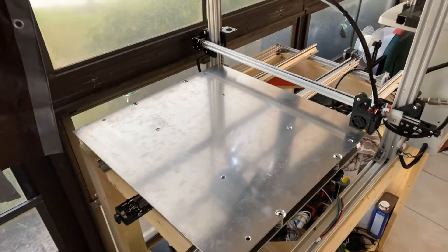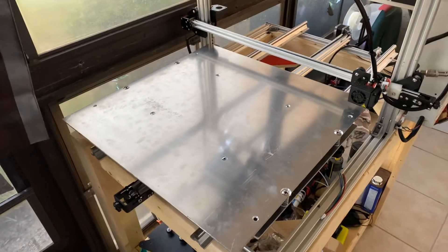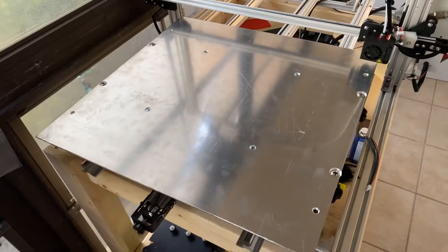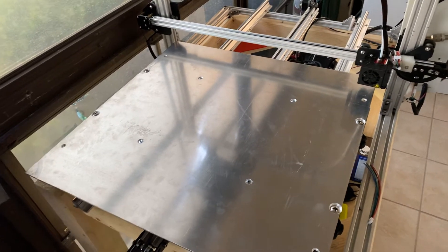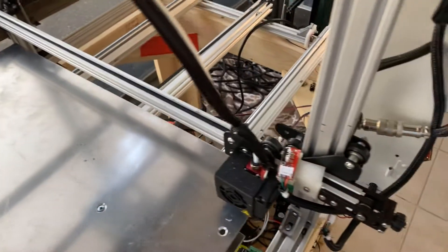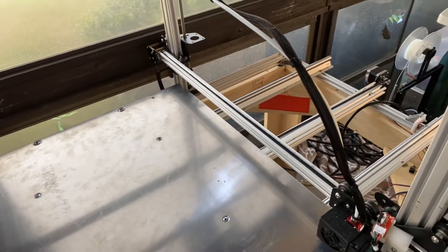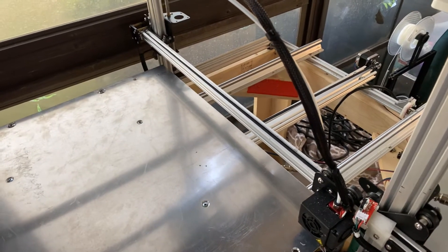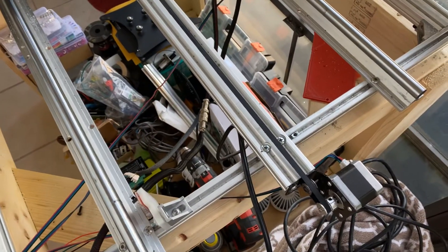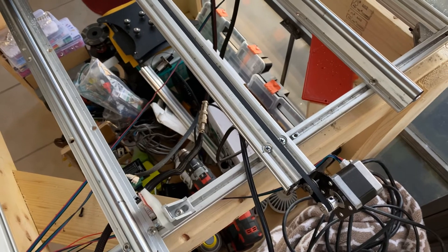Here's a quick update on what's going on with the large 3D printer. I'm definitely running into some snags as you can see from some of the previous videos, but I'm definitely working on something hopefully promising. The belt drive and all that stuff keeps missing steps when you start getting bigger printers — that's when you start having serious issues. Even though I'm still running on little NEMA 17 motors, I've figured out a way to start using the bigger stepper motors.